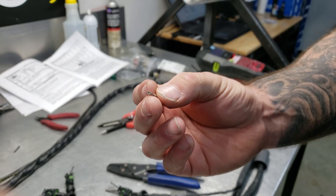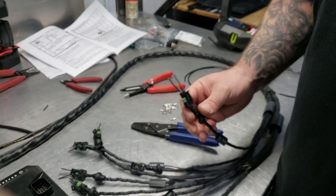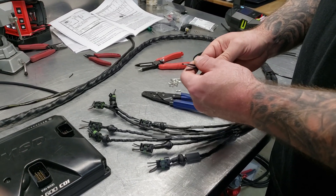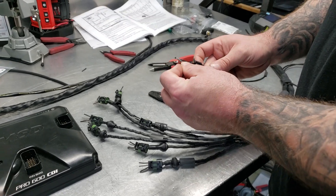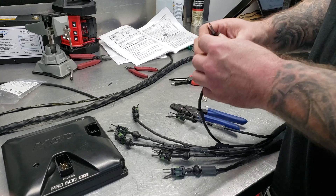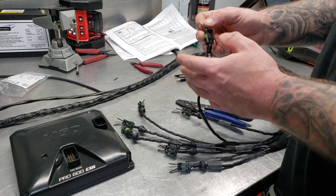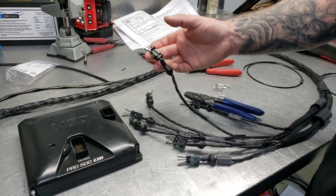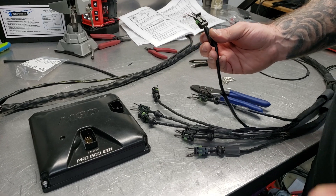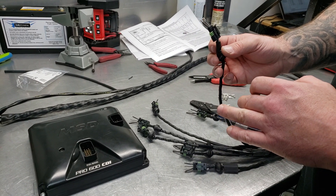So there's your terminal, and you actually have to run the wire through the connector like this — up and through — and then you strip it. You strip your wire, crimp your terminal, pull it through, and then it's in. You have to go through the correct slot first. Once they're in, they're in. Don't even try to get them out — they're a pain. Take your time and do this stuff right.